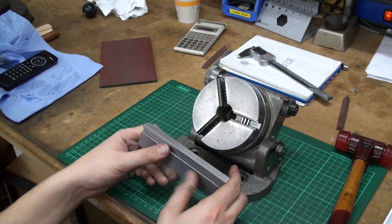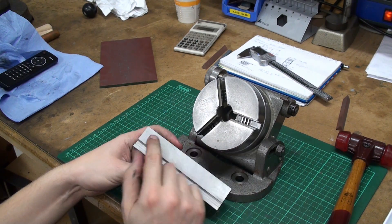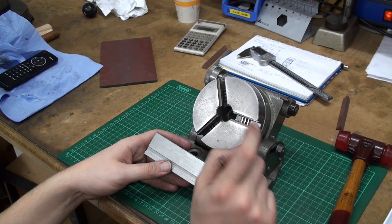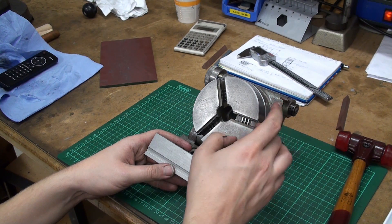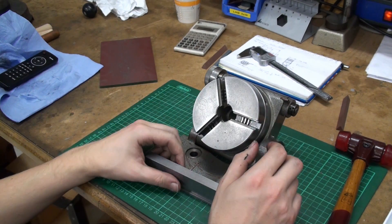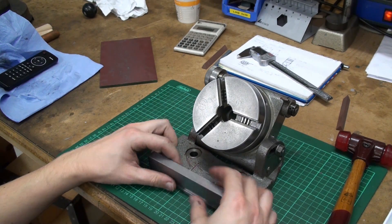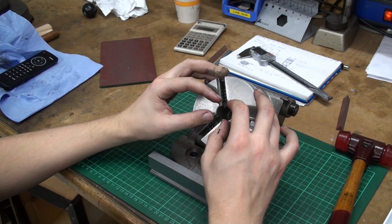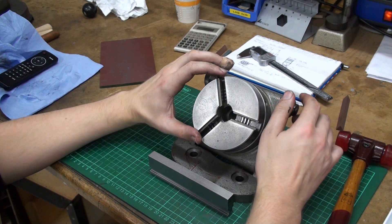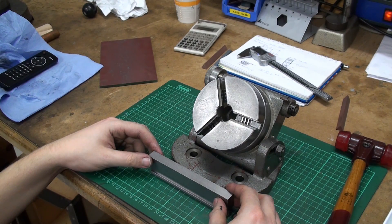Next step will be to cut the jaws apart so I get three little jaws. Then I will go over to the copy milling machine and machine the serrations. Final work to be done is chamfering the front edges of the jaws, machining the stepped outside contour, and hand finishing to the chuck. Each jaw will get fitted to its corresponding slot so everything runs nicely but tight. When I have it finished, I'll put the jaws in, preload with a ring in the center, and bore the jaws out so I get a perfect runout — or no runout. I'll show this in the next part of this project. Thank you for watching so far.